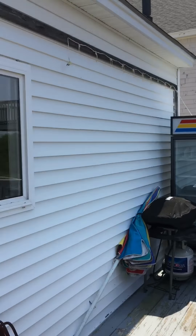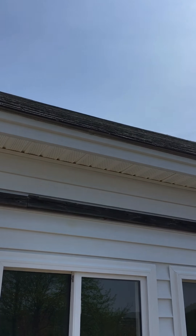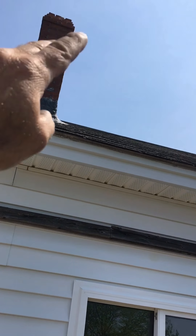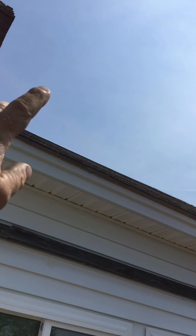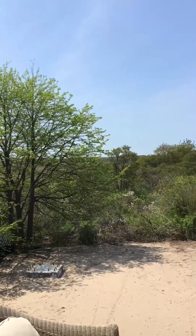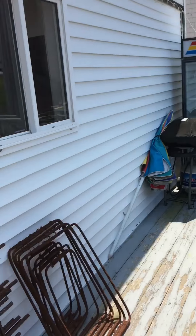That's what I have to do — open this wall up and get the framing in there to accept the header to carry the floor, and then we'll probably end up jacking up to carry the roof on the bridge as well. I call it a bridge — it's a bridge to get over into the new addition from the old house. I'm going to tear it apart from the inside and leave the exterior weather-tight.